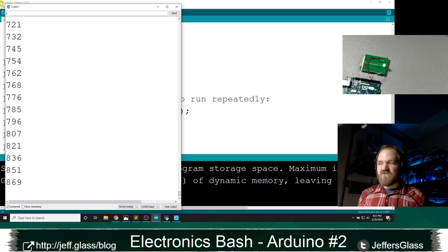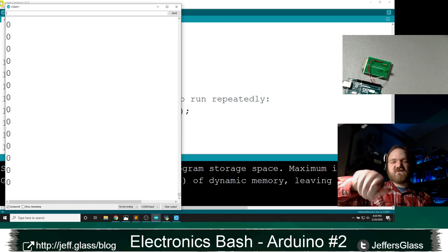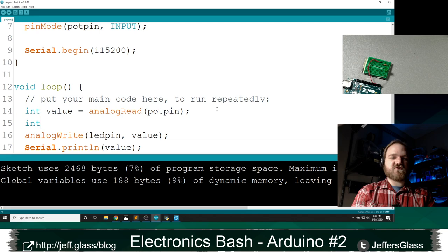But that's not really the behavior I want, right? As I turn this all the way down, I sort of get 4 different ranges of fading. And I really want it to be just a continuous range. When I spin this pin all the way down, it's dim. When I spin it all the way up, it's all the way bright, right? So for this, we're going to use, as Chris has so rightly guessed, the map function. And here's how the map function works. I'm going to define a new variable called mappedValue, and it's going to take the value of the map